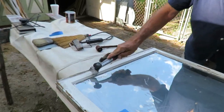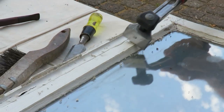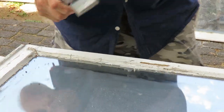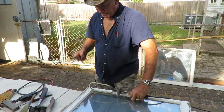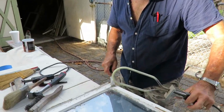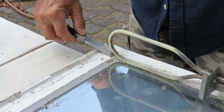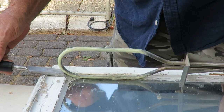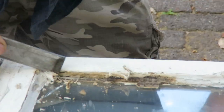The first thing I'm going to do is take a scraper and go around the perimeter of the sash to break this paint seal — that will make the glazing putty come out a lot easier. So let's start out in the corner here. You don't want to get too far into the corner because you can burn the sash, so I'm going to use this chisel as a heat sink and hold it on here for about 20 seconds.